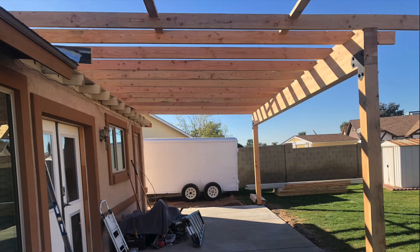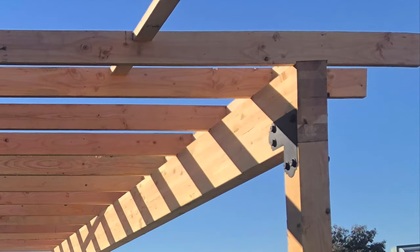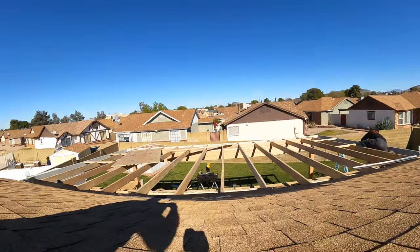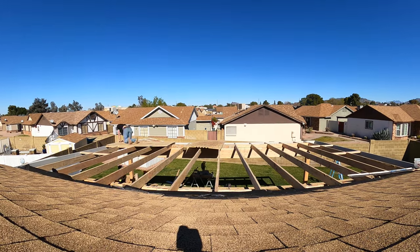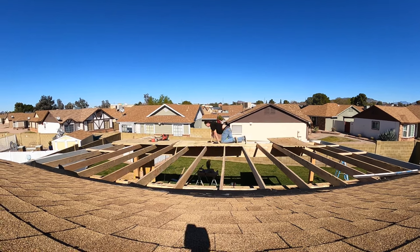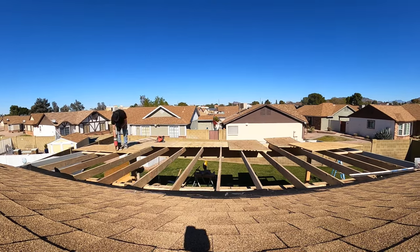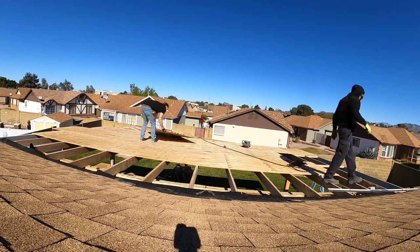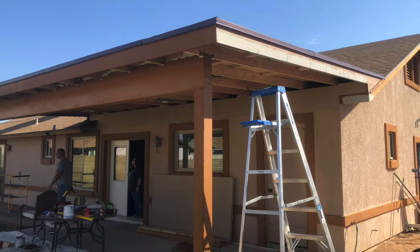Here is pretty much the overview of the entire framing. You want to make sure you crown your boards — those rafters on top, make sure you crown them. Here is a zoom in of the bird's mouth. It's professional to do a bird's mouth, but you DIY people could probably just lay the rafter on top — it's not a big deal because it's such a low slope of a roof. Make sure you put blocking in between your rafters. I have to do it in Arizona per code. You want to make sure you have a helper throw the boards up or else it can be really arduous. Put some plywood up — we like using 19/32nds plywood, but you're totally fine with OSB. Make sure your nail patterns are 6 and 12 inch all the way around.